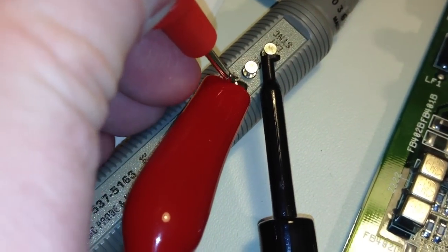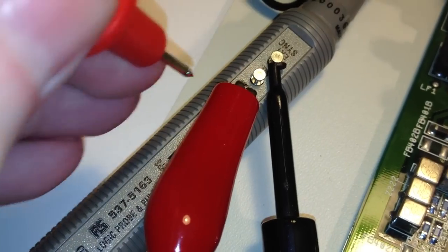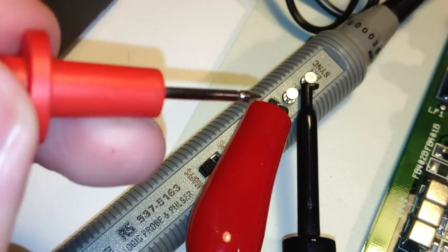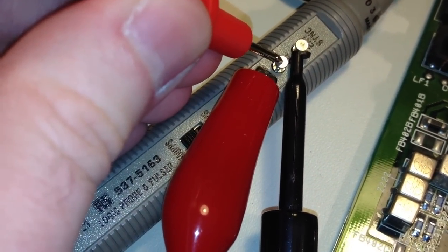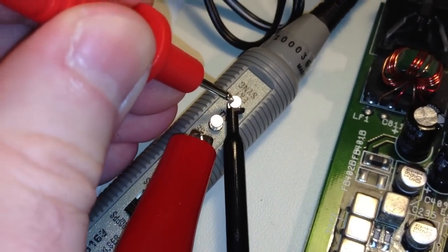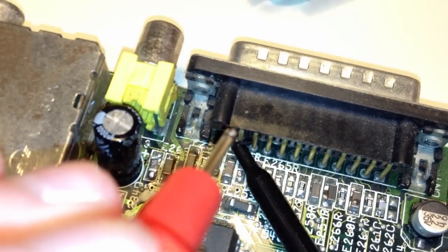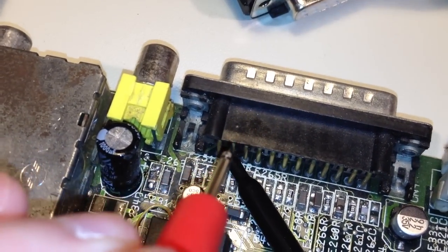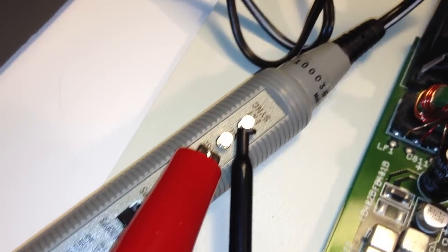And here at this point, we have our pulse signal coming out that we are gonna inject into the video DAC using this probe. And here we have a square wave coming out. We're not that interested in that now. And here is the external sync input. And I have that connected to this point here, right at the 23-pin D-sub connector. So here we have our horizontal sync signal. And that is going into the external sync here of the logic pulser.